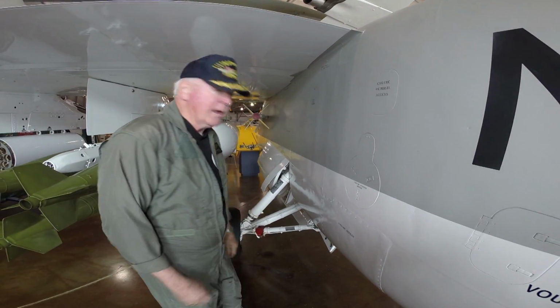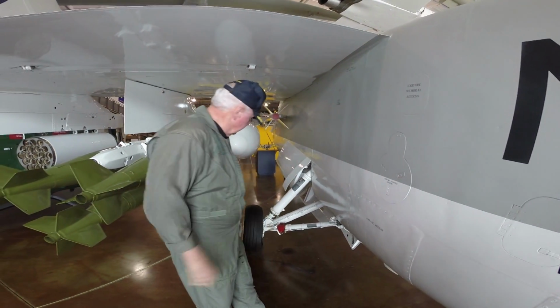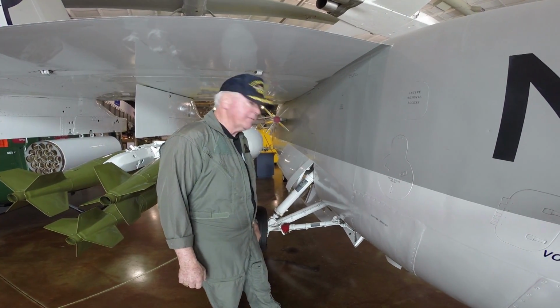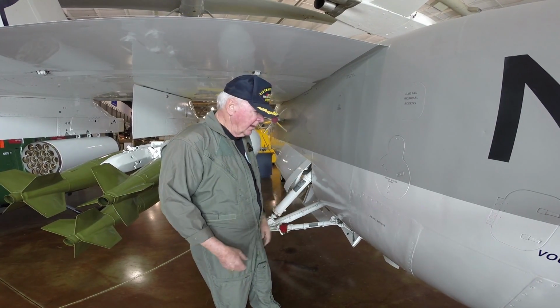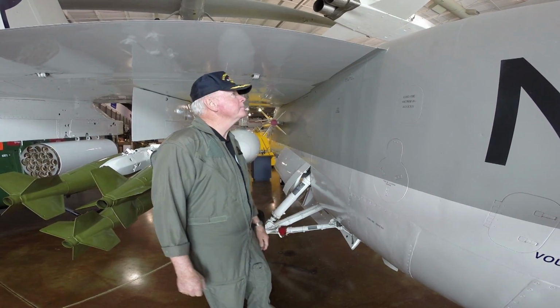They started the airplane with what we call the huffer, blue air. Get in here, start it up, spin the engine. I think, well, I should know these numbers, but I forgot them. About 15%. Come around the horn. You get igniters, fuel's being fed, lights off, starts up, easy peasy.